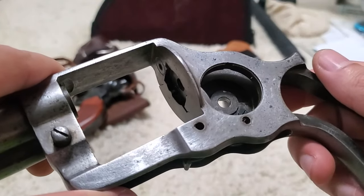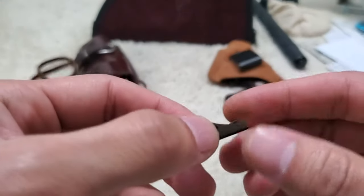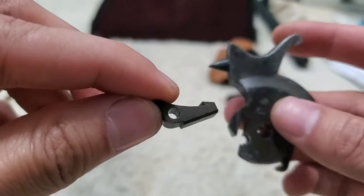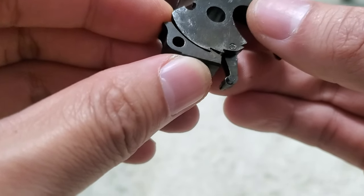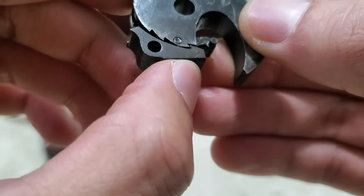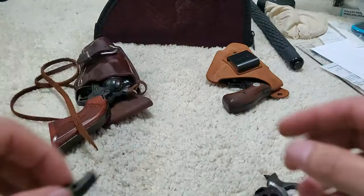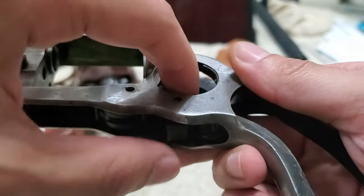Next part — I think it's going to be the sear. The sear is this guy right here. The way it interfaces on the hammer is this catch part end is going to be on the right side. When you cock the gun, you've got that first safety — which isn't a safety — and you've got the load and unload, and then the final one is the trigger and the hammer ready to fire when you pull the trigger. I like to put this in first because it gives me a lot less nightmares. When you put in the hammer, it connects everything together.